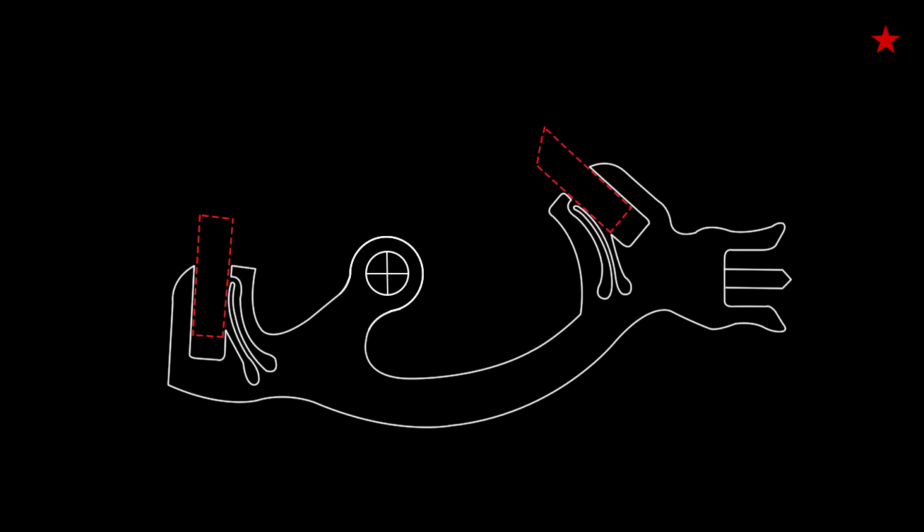So with this patented design, as you can see, you have this flexible fin here that presses against the pallet stone, holds it in place while you check how it's engaging with the escape wheel. You can adjust as much as you want until you've got it exactly right, and then you fix it in place with shellac or whatever. It's a very neat solution.